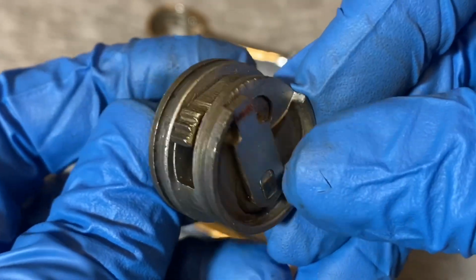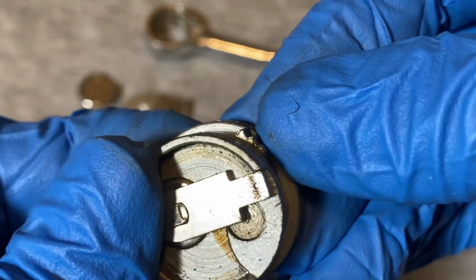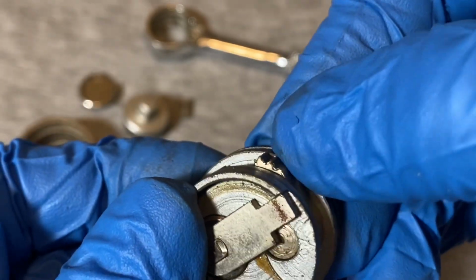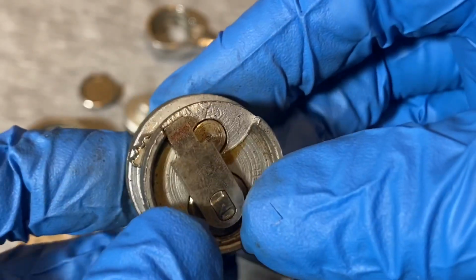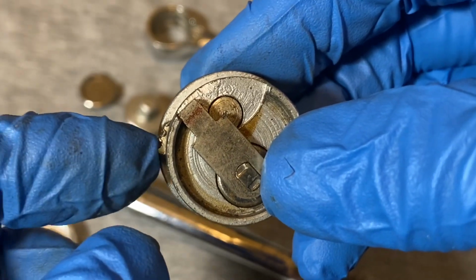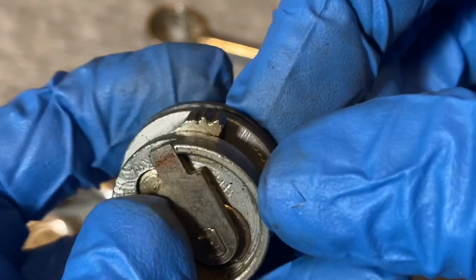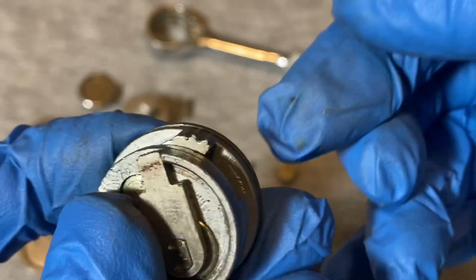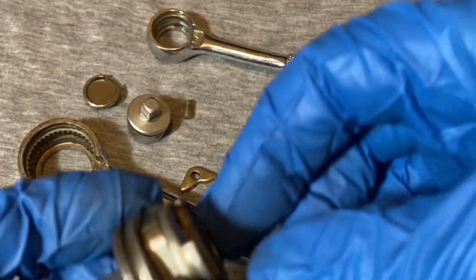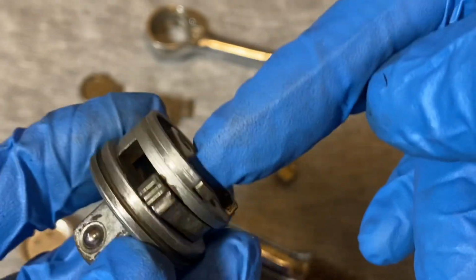This one, the teeth look a little bit, say, deformed or something, but it does ratchet well. I don't know if that was from too much torque or it could be bad machining. Here's a look at the teeth. Only 2 teeth hold these ratchets. These are just 2-teeth ratchets, and you can see how thin the pawls are. But let me take this one apart.